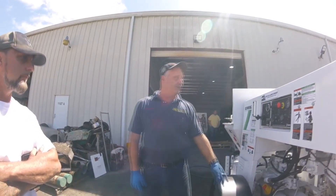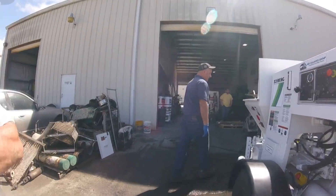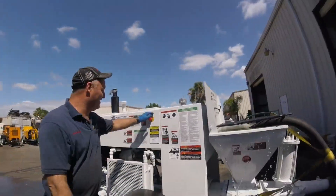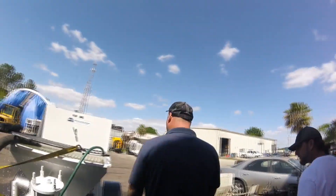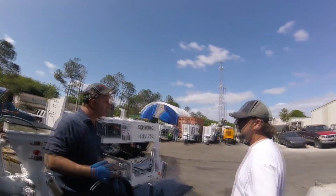Or a related e-stop issue — meaning fuse F2 has blown. Wires stuck together or something's gotten wet behind one of them. One of them is exposed on the far side, so if you've got enough mud and dirt in it or pressure wash right into it, you can definitely short them out. It's a micro-flip, so if you leave them in the sun, dry them out with a hair dryer. They've got a weather pack in them, but if you put a pressure washer right in it, anything's going to get water.